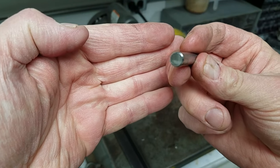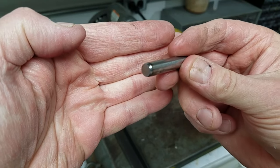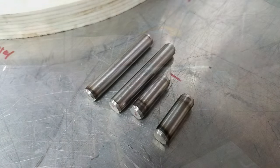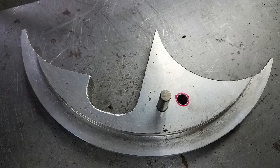The dowel pin is supposed to be a hard press fit in the bearing plate and a slip fit into the blower case. The standard method is to use a five-tenths undersized reamer for the press fit and a five-tenths oversize reamer for the slip fit. To simplify tooling and eliminate one additional reaming process, I used only a single letter P reamer, which sized the holes the same in both the bearing plate and the blower case. To test my fit after reaming the holes without altering my good blower parts, I took a piece of scrap aluminum, drilled a 5/16 hole in it, and reamed that hole with the letter P reamer.